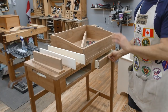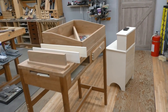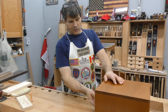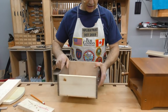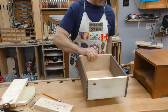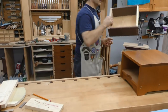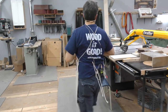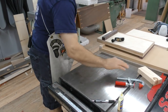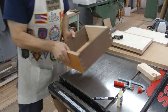This one's a little bit snug, but it still needs work — I've been working on it for a while, so I'll let it acclimate a bit more and then go back in for a final fit and get it perfect. In order for this drawer to work properly, when it sits on a flat surface it can't rock — no corner to corner movement; it's got to sit perfectly flat. Let me take that over to a known flat surface and check it. Okay, no movement there. It's time to flatten my bench again.